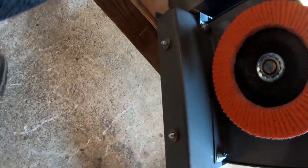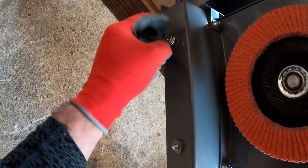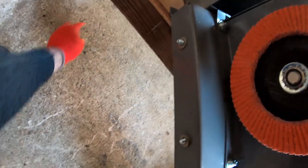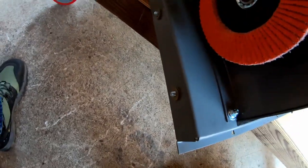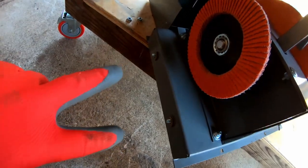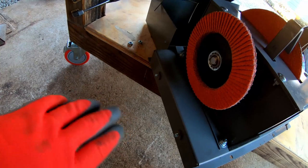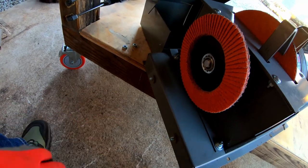So anyway, 4 washers on the inside, 2 on the outside, and then I'm probably going to put the camera down to get this started because it's going to want to fall out. Yeah, I'm going to have to. So what we'll do is we'll put the nut on each bolt and then go ahead and tighten it up, and what that's going to do is seat the bolt. So do that on both of them, get them seated, and then when I take the nut and the 2 washers back off, it should be in there, fixed in place. If it's loose, then I need to do that again and make sure that they're in there good and tight, and then we'll be ready to put our guard on.